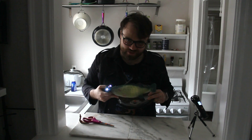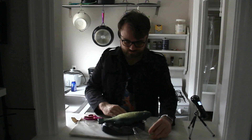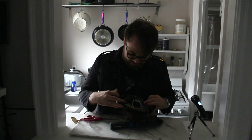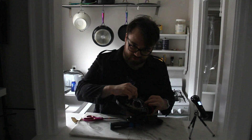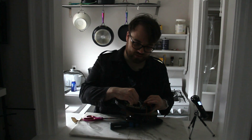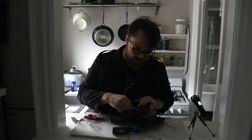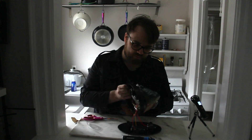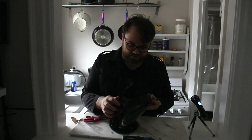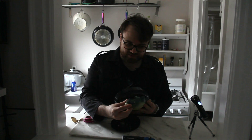We have the Billy Mouth Bass here. The two cables that we'll need to cut are this one right here that controls the pivot motor, and then this one controls the mouth. Once you cut those two, you can wire them. This motor controls the fish's ability to move like this, and also like this. This motor that's built in here just controls its mouth movements. Run the four wires from the corresponding motor locations to each side of the motor driver.